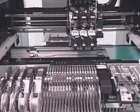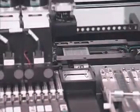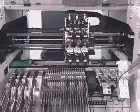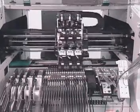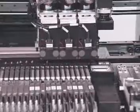The sizes of PCBs that can be worked on range from 50 by 30 millimeters to 460 by 400 millimeters, and a total of 104 feeders can be inserted on the front and rear side. The CP40 series conveyor consists of three stages, reducing the PCB traveling time.